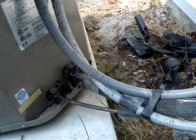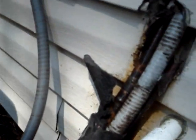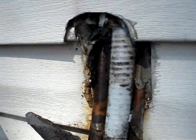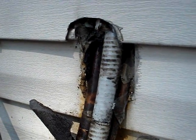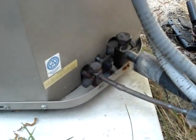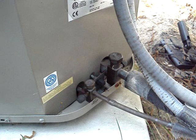Alright, here's our call for today — a Goodman CPLE 30-1 from 2003 heat pump with no refrigerant. We've been here a few times the last couple years, topping off refrigerant, but we ended up finding a leak inside the wall. You can see all the oil spray right there — it really opened up. It had 300 pounds on it and you could actually hear it. At first it was leaking pretty slow, but by now it would have leaked out by the time I got home in the van. I shut the service valves to separate the outdoor unit from the lines and indoor unit, and when I realized the indoor unit was the source, I went up in the attic.